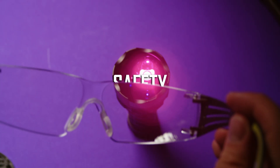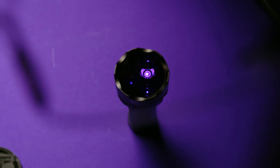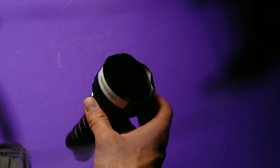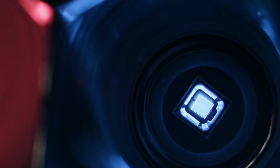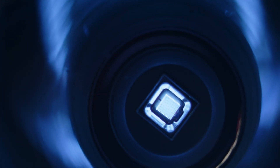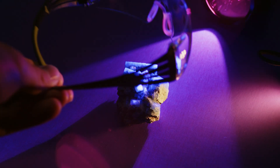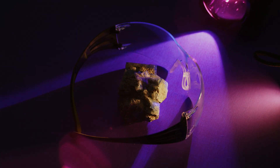Safety is important with this light, as it emits high energy waves of the type normally blocked by the Earth's ozone. In particular, the high-power UVC light plants this into the category of "cancer ray." The beam should not be shined on exposed skin, and eye protection is required when operating this light. Nothing fancy is needed — simple polycarbonate safety glasses are enough to block the harmful rays.